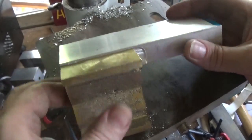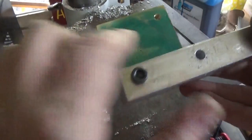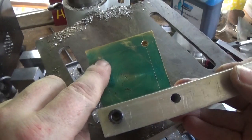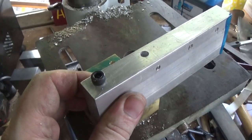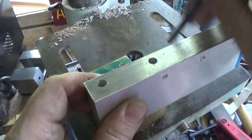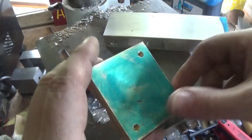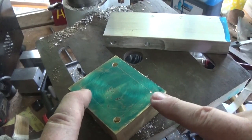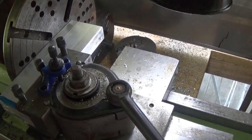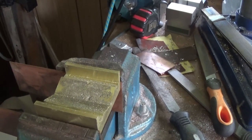So I got up this morning and made this jig. It's got a step on there to get this nice and parallel. I've drilled and tapped one hole in here, drilled another, then spotted the other one through to get the second hole. That'll go in the tool post of the lathe. The next job is to tap these other two holes, bolt them all up and see how it's going to work. So this is back in and set up nice and true against the face plate.